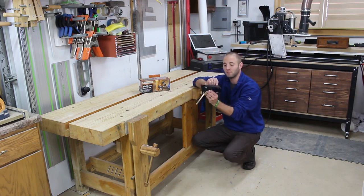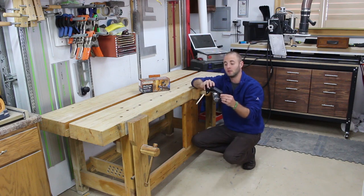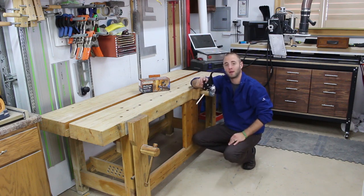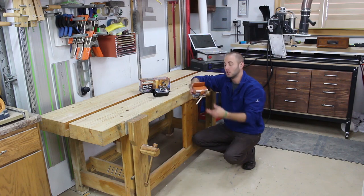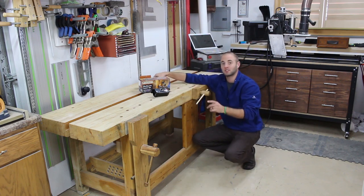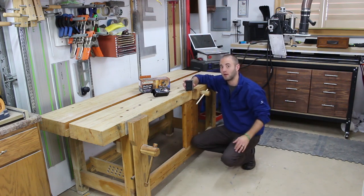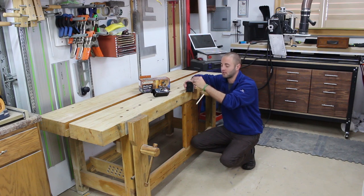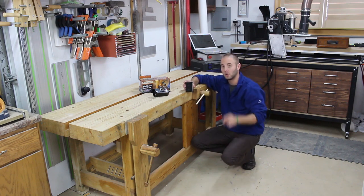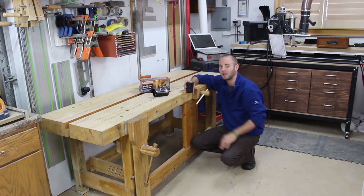The idea is a simple press of the foot raises your workbench three-quarters of an inch off the ground, and it rides on two and three-eighths inch wheels that are easy to move around. Then you simply raise it up and it drops the workbench exactly where you need it. In addition, Rockler has these quick release workbench caster plates — you need one caster set and multiple caster plates. You can pull them off your workbench, put them on a drill press table, move the drill press around, then bring them back by lifting the pin, sliding the casters in, and securing them by putting the pin back.